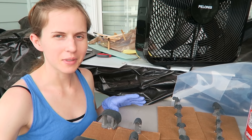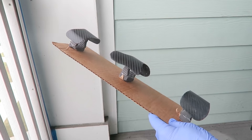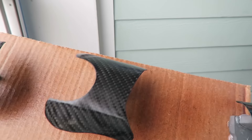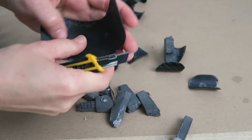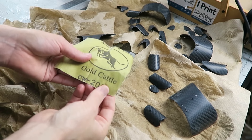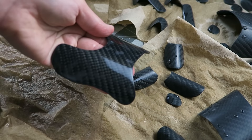Some of the issues I've had are with the epoxy kind of bubbling up, and I've had to apply gray sealer in some spots, so they look really dull again after sanding — down to 400 grit now. I'm going to use the sealer to bring back out that carbon fiber look. The enamel doesn't normally have as much of a problem, but I'm going to need to polish everything still. I started out with 2000 grit just trying to get a perfectly smooth finish.